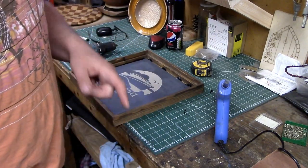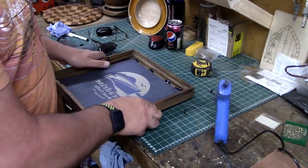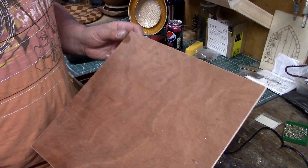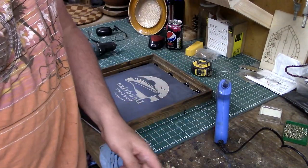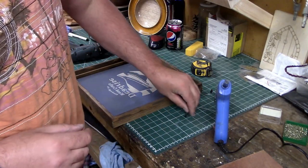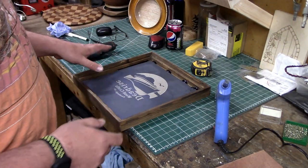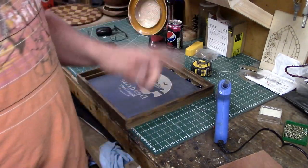Frame's all dry. I've started putting the glass in — apologies for not pressing record sooner. I'm gluing the glass in with some hot melt glue but doing little bits at a time so I don't heat fracture the glass, because the glue's hot and the mirror's not very warm and I don't want it to shatter. I've cut the back ready to go in, and I'm just going to hold the back in with some little tiny two by ten screws. I was going to illuminate it but because it's being shipped over to the States and being bashed about, I decided not to — I don't want it to get to Emmett and then not work. So I decided just to put a back on it and to be honest it still looks quite cool with nothing in the back.